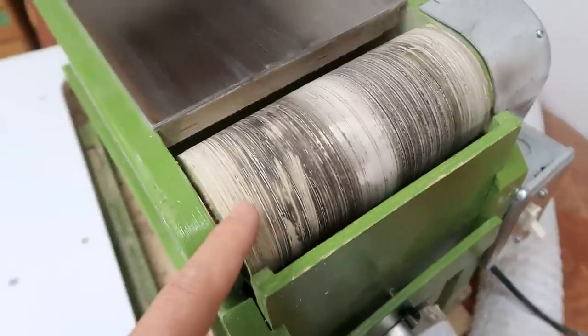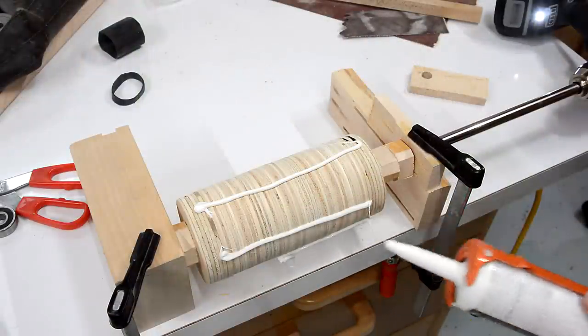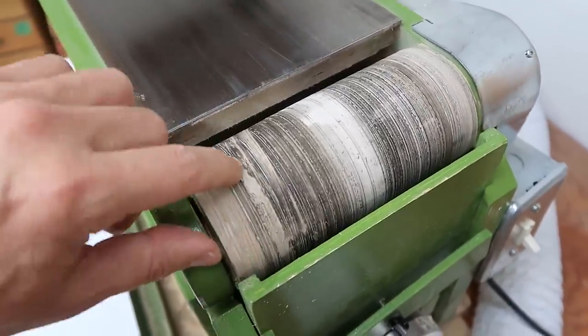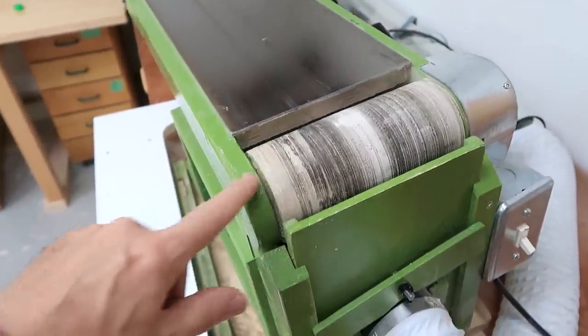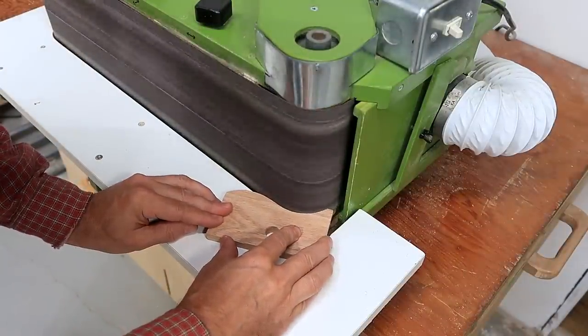For the drive roller, because it's bigger I couldn't quite stretch an inner tube over it. So I coated it with caulking, spread evenly, and that has for the most part held up except for one spot — there's a bit of a gash right at the level of the table where I do most of my sanding. If I was building it now, I'd probably buy a fat bike inner tube to put over that bigger roller, but back in 2006 those weren't very common.